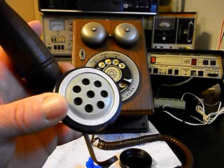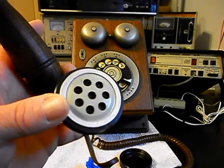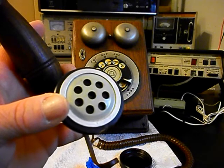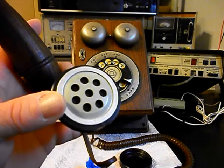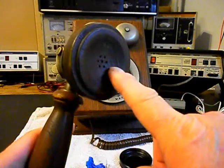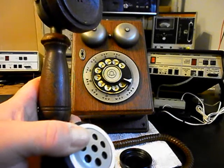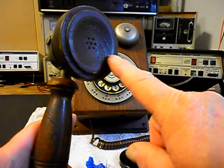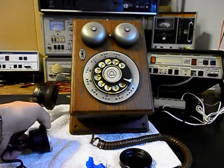They will crackle and pop and cause a lot of issues when you're trying to talk on the telephone. So what we want to do is replace this T1 transmitter with an electronic amplified transmitter that we design and build here at the shop. They have a much higher quality of transmit power. Now when we replace the T1, the receive will increase because it takes the load off of the telephone — the T1 will pull quite a bit of voltage out of the telephone line. The receive will go up when we replace it with an electronic amplified transmitter.